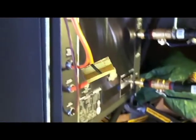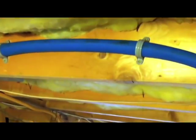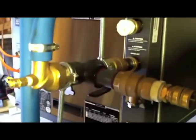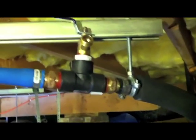The brown wire is the thermostat, and the other one coming out goes to the flow center. Here's the loop piping coming in — it goes to the QT flow center, which is basically just a pump. It's a constant-velocity pump that keeps water circulating through the system when it's on. The piping goes over to the heat pump. Here's the water connect kit — it has pressure and temperature ports for checking the temperature going in and out. Then the water loop goes back out, and I installed a valve to bleed off air on that side of the loop before it goes back out to the well.